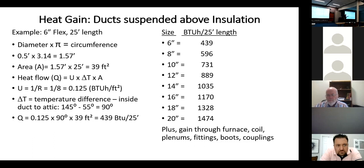In an attic full of an HVAC system you'll see all different flex sizes. That 20-inch flex run for a return — 25 feet of it — is almost 1,500 BTUs just for that one piece. With all the different lengths of flex strung all over the attic, we can have one ton, two tons, even two and a half tons of cooling required just to overcome the heat gain through the ducts. We just need to bury them in the insulation.